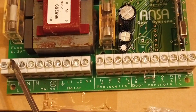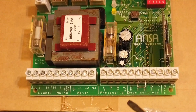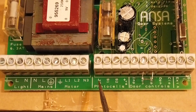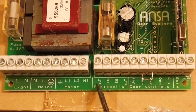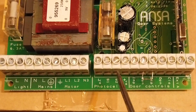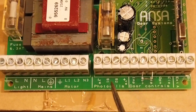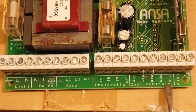The photo cell side of the board is all 12 volts; the other side is 240 volts. The control panel works on 12 volts through this transformer unit, which reduces it down from 240 volts to 12 volts. We've got 12 volts across those two pins, which means your photo cell has got power to work. When the door's clear, the photo cell will put 12 volts down its signal wire to S1 and S2. We're looking for 12 volts through the photo cell back to S2 - if that's okay, the motor should work.